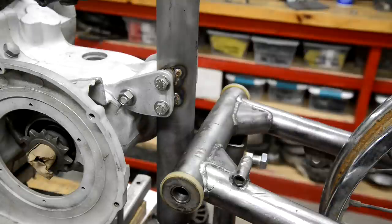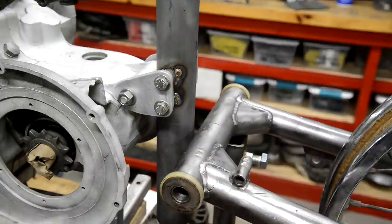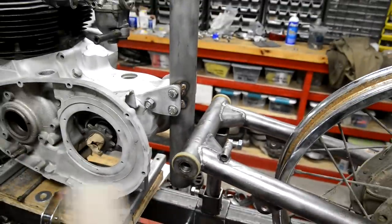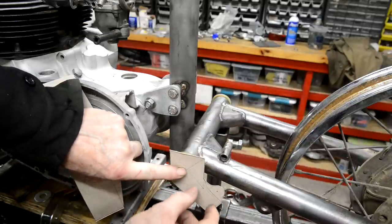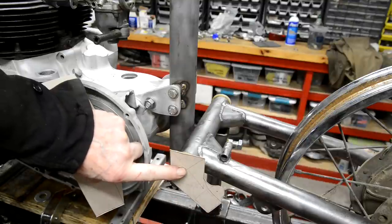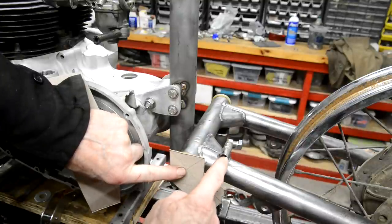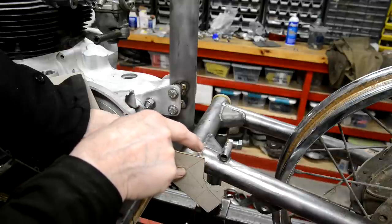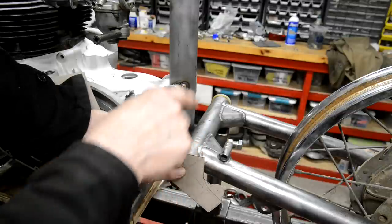So, hang on a minute. We are going to have an end to it like that. You can't see it. Oh dear. How's that? There. So that will be there like that, with our footrest sticking out here. Okay? This will have a top, it'll have a back, it'll have a bottom. That's the bit I mentioned. See, that's going to come up. So what I might do is, although it'll be welded to here, I might just come in, make the box here, not 2 inches, say 1 3/4, just scallop it there.